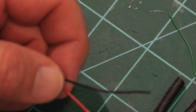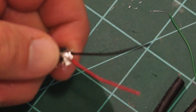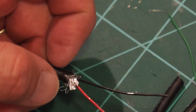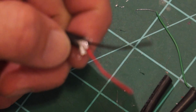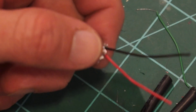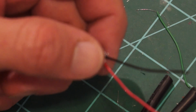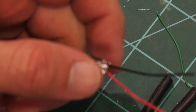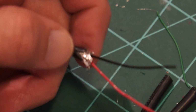Each LED takes 20 milliamps, and they're orange, so they're about 2 volts each. So it wouldn't surprise me if they just put the 3 in series. Without opening the back of the box, I won't know for sure, okay? So if they're in series, about 2 volts each, that's 6 volts, and they're underpowered anyhow. And I'm not running a risk of blowing them out at 5 volts. But I'd rather add a resistor to it just because and lower the voltage a little bit on the output.